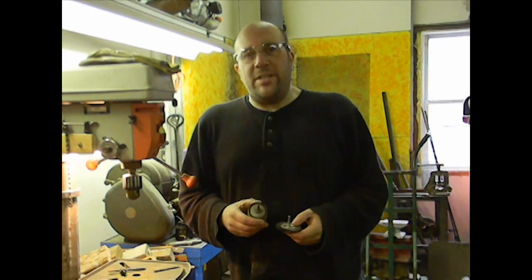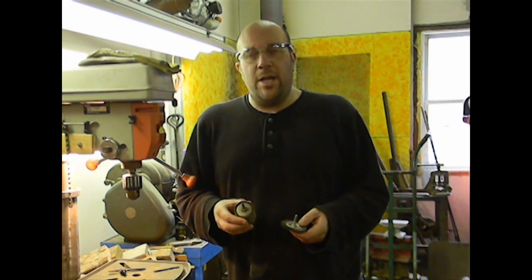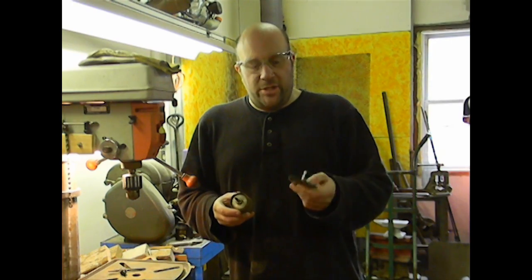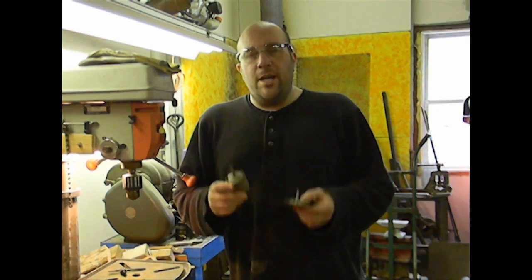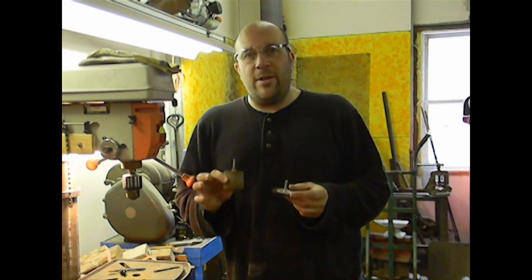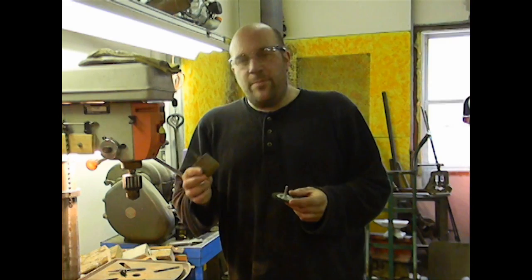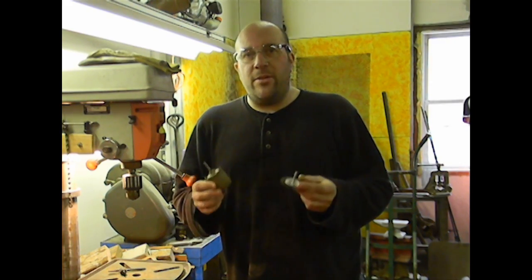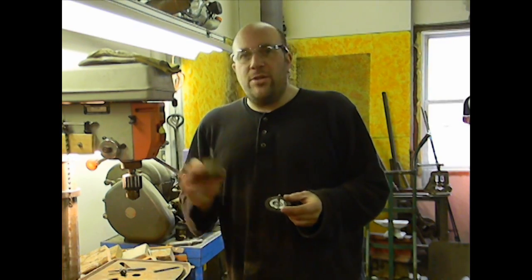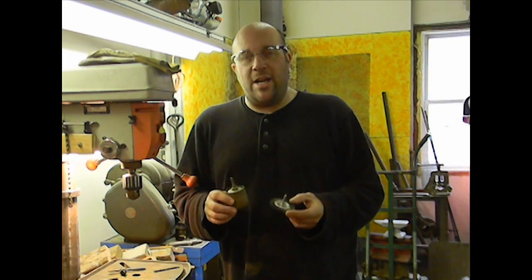Well, YouTube, I hope that gives you a basic idea of some of the things you can use your drill press for, other than simply drilling holes. But before you go out and get accessories like wire wheels or drum sanders, make sure that you're buying quality tools and that they are rated for the amount of RPMs your drill press is capable of producing. If you have something that's only rated for 2,600 to 3,000 RPMs, make sure you don't exceed that with your drill press — some drill presses can go significantly higher.